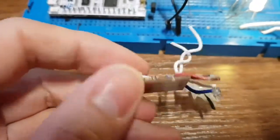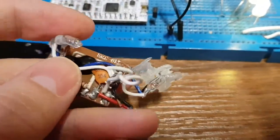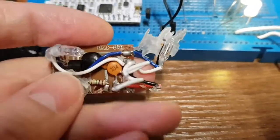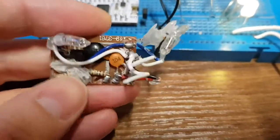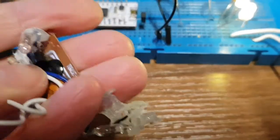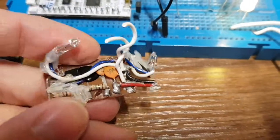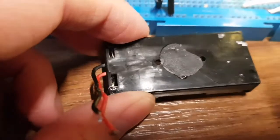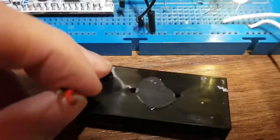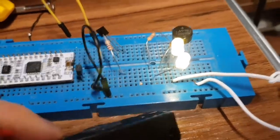The board in here is very simple — just a little blob circuit. All it's doing is: you've got a little contact switch hooked on these two white wires, and that just turns the lights on and off. There's a little transistor here which does the switching — so this can go in the bin now. All I've got to do is fit the new circuit on there, and I've also wired up the battery connection so it could still run off batteries if you wished, which will give it a longer life.